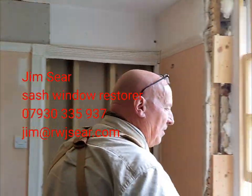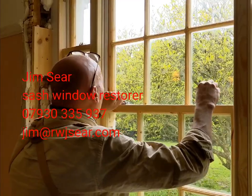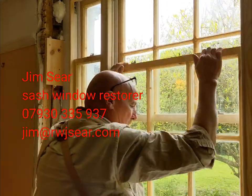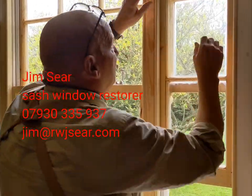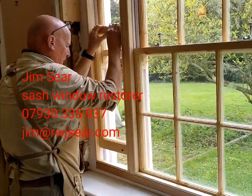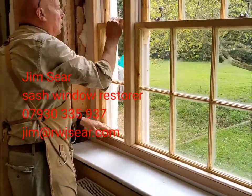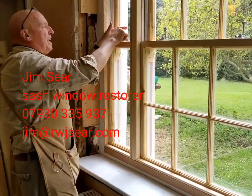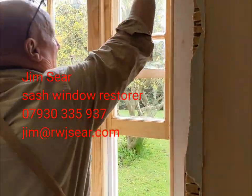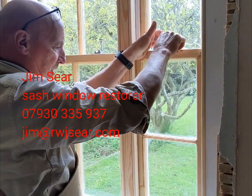Okay, right. The sashes are working now. That goes up and down, smooth as anything. That goes up and down, smooth as anything. These are friction. And these are friction. There we are. Now, normally these ones don't work, but we've made them to work. The top sash stays in place. Now, the bottom sash on the outsides will open under friction. That's it.